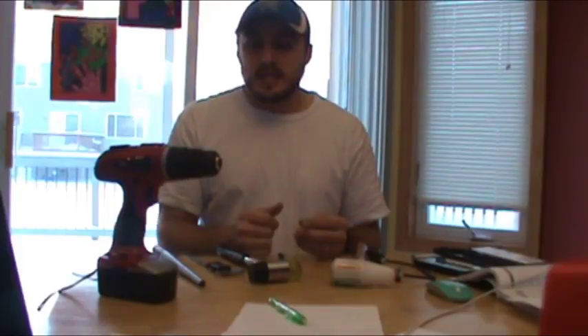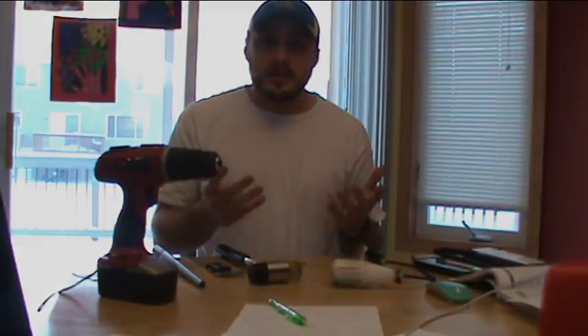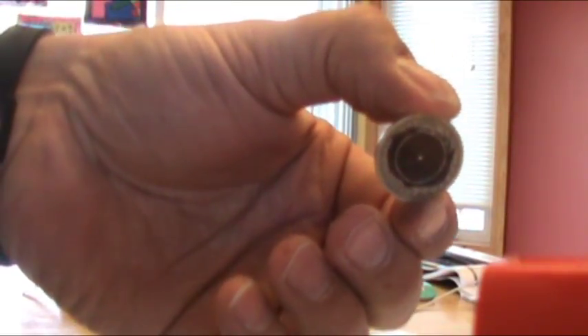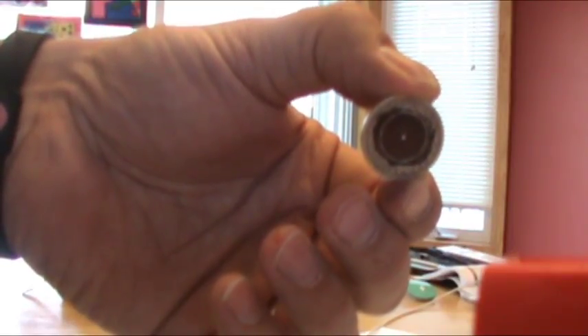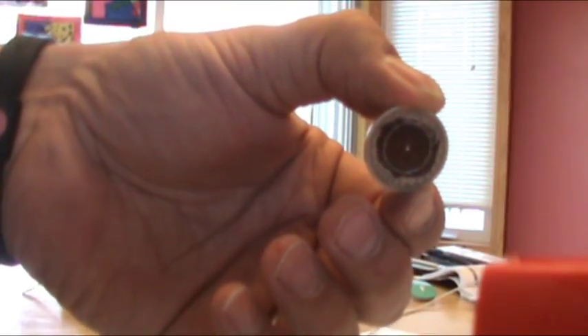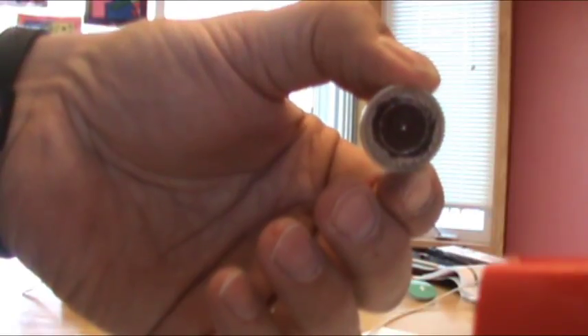You stay within the lines — very elementary. I'm going to blacken and cut my coin, and we'll go from there. As you can see, there's my center, and I scribed a perfect circle which is the exact size of the tip of my mandrel. So when I cut with my jewelry saw or drill it out and file my way to the edge, I know exactly where the dead center is, which in the end will produce a much more high-quality ring. I'll cut it out and we'll jump from there.